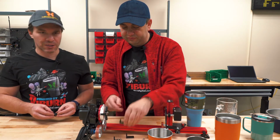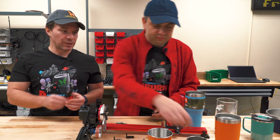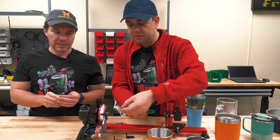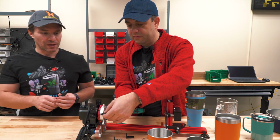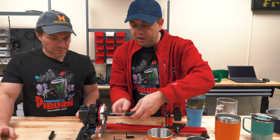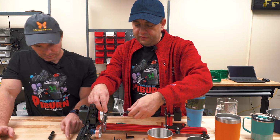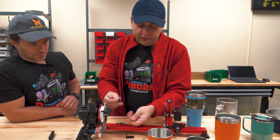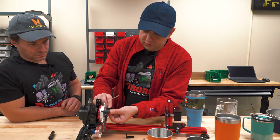It was really awesome to see, and overwhelming, frankly, with the folks that really wanted to do dog bowls and really wide diameter objects. And you guys were asking us, can you please include this with the grip? And we decided to include it with every single grip we're selling. So you attach these using the included M4 by 10 millimeter screws, and they just go right inside the jaws. They sit flush, and there's nothing stopping the cup. And you only have to use two. There are 3 holes, because you can move them out slightly, or you can put them inside.